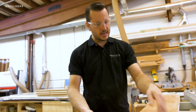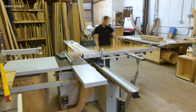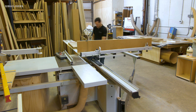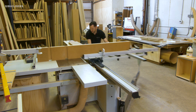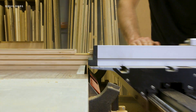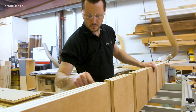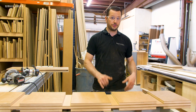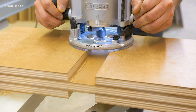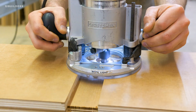Now we have our piece trimmed to size — long edges are parallel, returns are square. We can now begin to lay out for those notches. Right now I'm setting up and doing a few experiments to find the most efficient cutting method. Cutting in multiple passes on the saw is time consuming and dirty, and using just the router is also very time consuming. So I'm leaning toward a combination of the two — using the table saw to cut from all three sides with great accuracy, then coming back to clean up these notches with the router for a nice clean flat bottom, meaning fewer passes on the table saw overall.